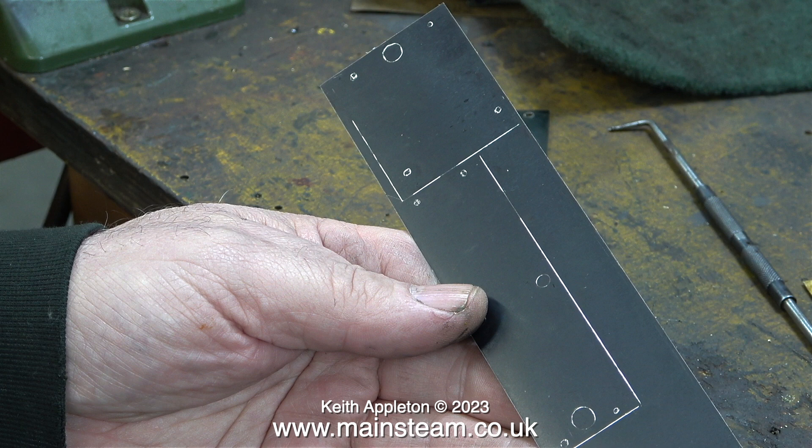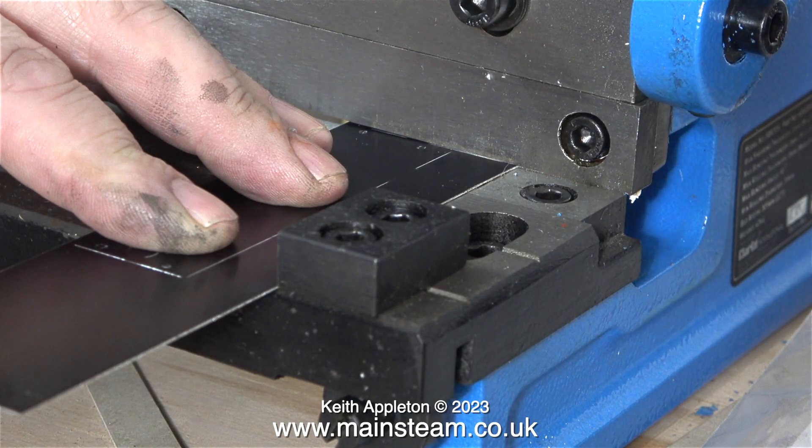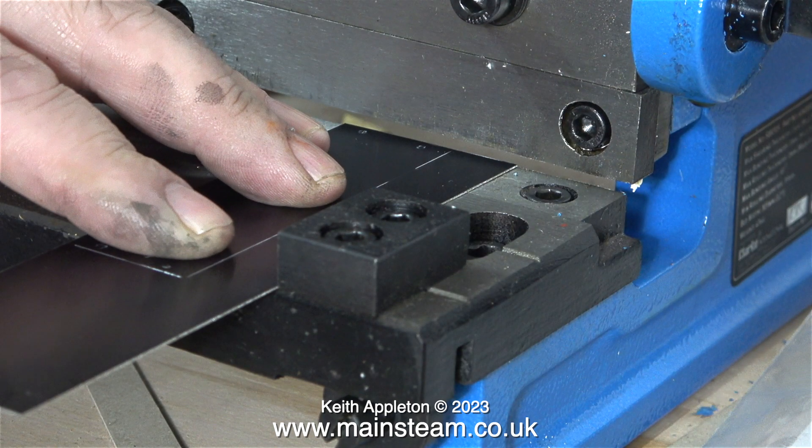Here's the story so far — quite simple. All I need to do is just cut on the lines. I'm going to use this gadget that I bought a while back. It's called a Clark Metalworker and it's really useful. Not only is it a guillotine, it has bending rollers in the top. A health and safety warning: I have removed the guard so the blade is exposed. This machine is potentially dangerous with an exposed blade, but I'll try not to put my fingers in there, and I will replace the guard as soon as I've finished the job. The guide at the right hand side at the front is very useful because it makes sure that the piece of sheet metal being cut by the guillotine is square to the blade. There goes the first cut — one down.